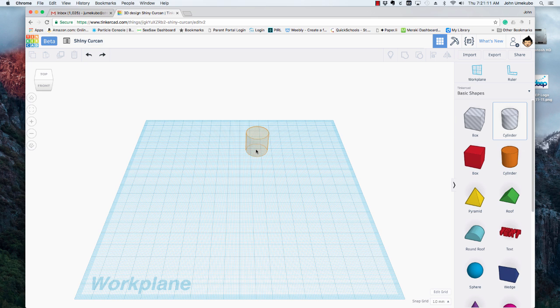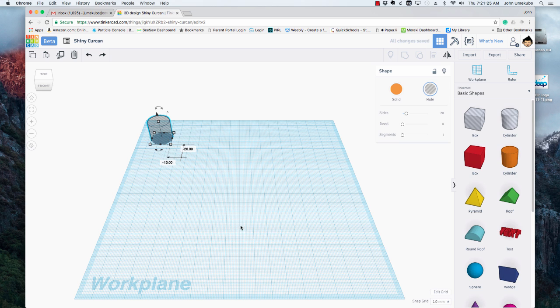I bring out some pieces that I'm going to use over and over, so I'm going to get them kind of set up and leave them here as my supply list. I know that in the 3D printers we have, the bearing is 22 millimeters in diameter. If I make the hole 22 and a half millimeters, that's about the right size so the bearing will fit snugly without needing any glue, and you don't have to hammer it in — you can just plop it right in. This becomes the piece that the bearing will be placed in.